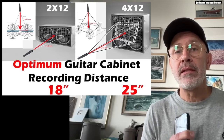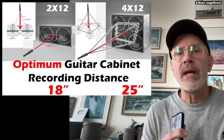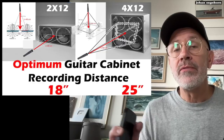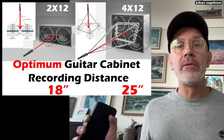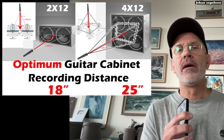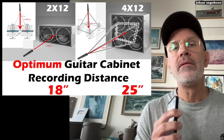And the cool thing is that this can actually be basically geometrically determined. Speakers are directional to different extents depending on frequency. The lowest frequency is just spread out, 180 degrees. But the higher the frequencies are, the more it becomes beaming. For the highest frequencies, the sound just beams out straight ahead.